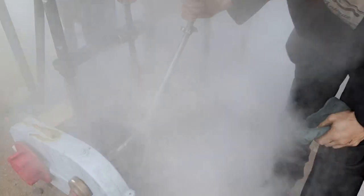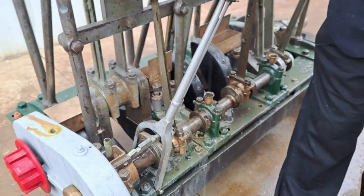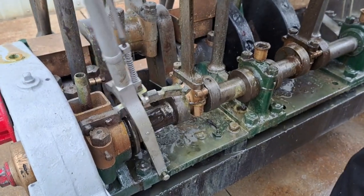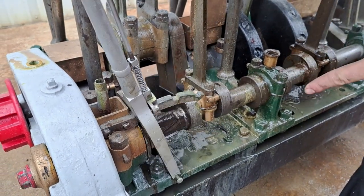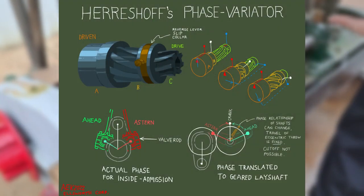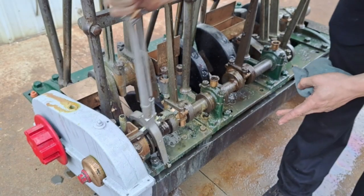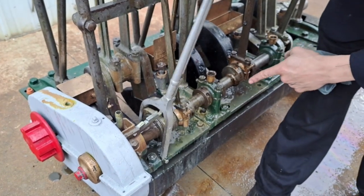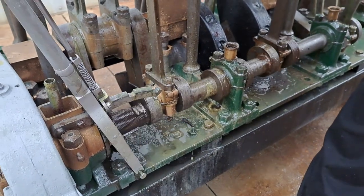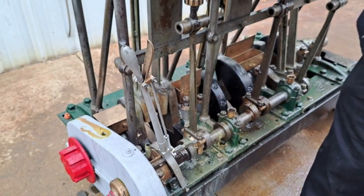Here's how that works. I'll stop the engine briefly so you can see it. What it does is change the relationship of the position of the eccentrics to the position of the cranks. The crank is stationary right now, but we're flipping the eccentric — from about 280 degrees to 80 degrees. You can't change the cutoff or advance the lead angle. You can add lead to it, but you won't change the travel of the valve, so it doesn't do much good for cutting off. That's why there are only three positions. But it's very simple and very elegant.